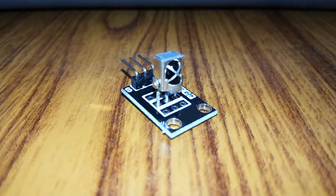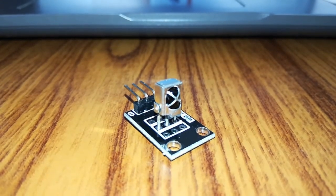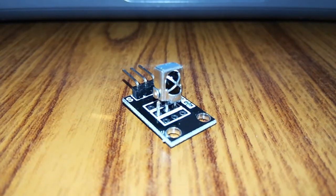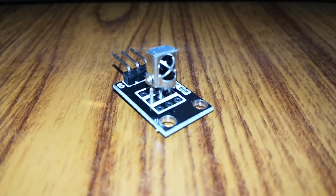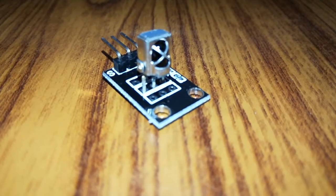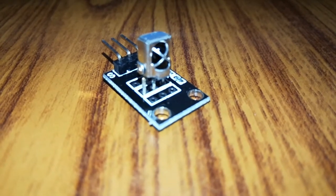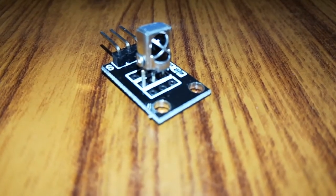Its working is very simple to understand. The emitter is simply an IR LED. The detector is simply an IR photodiode. A photodiode is sensitive to IR light on the same wavelength which is emitted by an IR LED. When IR light falls on the photodiode, the resistance and output voltage will change in proportion to the magnitude of IR light received. There are 5 basic elements used in a typical IR detection system: the first is IR infrared source, a transmission module or medium, the third is optical component, the fourth is an infrared detector or receiver, and the fifth is signal processing.